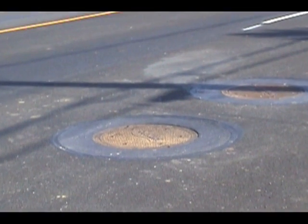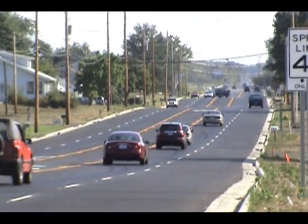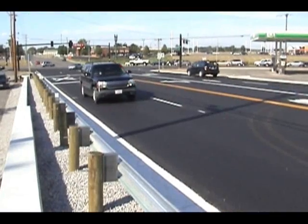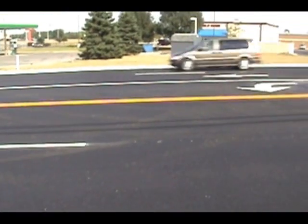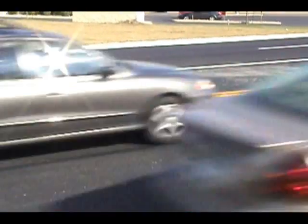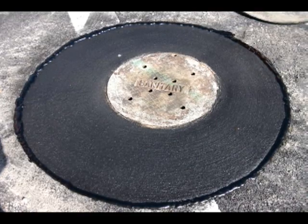These are not just speculative methods — they are currently in use in Allen County, Ohio. On State Route 81, there was a one-mile stretch with 54 manhole structures. Using this method, the pavers did their work and the Mr. Manhole crew came in and raised all structures to grade in four days. The structures were leak-free, vacuum testable, and perfectly level. The road was opened the following day, making this a great option to traditional methods for new construction or rebuilding existing roads.